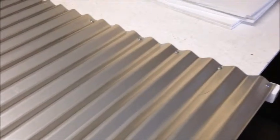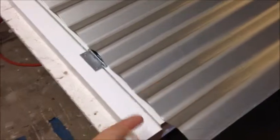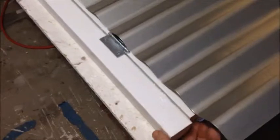Taking that 48 inch piece that you just screwed the two roof panels to, grab the 43 and 42.5 inch pieces with the hinge and slide the 42.5 inch piece underneath the roof with a 2.5 inch overhang. The 43 inch piece will be loose and will have the hinge part that opens. Start by putting a screw in the middle and then move outwards from there.